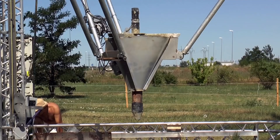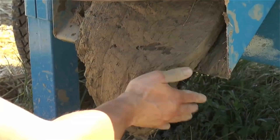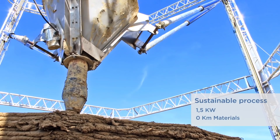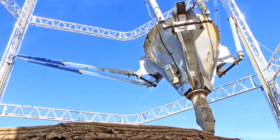A mixture of sand, clay, and straw gets loaded into a mixer at the optimal ratio, which then creates the mortar they're printing with. Some may refer to this combination as an adobe mixture — it's been used for thousands of years historically. There are parts of southwestern America where you can still see the remains of homes built with this technology. It will be fascinating to see the longevity of the homes Wasp is now printing.